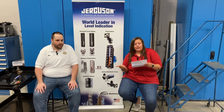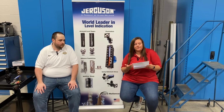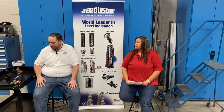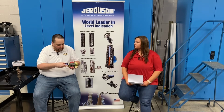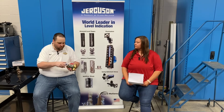Another question we had come in frequently, actually. Do low emissions valves come with quick close threads? That's an interesting question, and the answer kind of depends. I'll start with our 360 valve. This valve is standard as a quarter turn. Green is open and red is closed. It's just quarter turn. So there are no standard or quick closing threads on this one, so it doesn't apply.